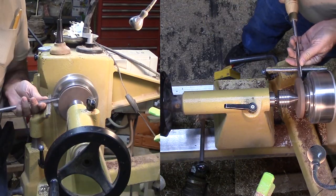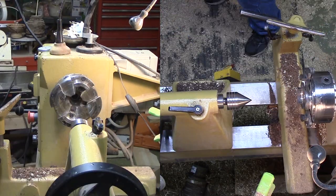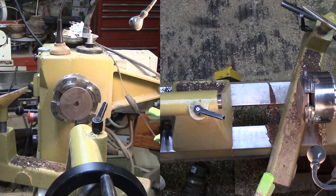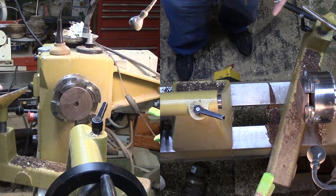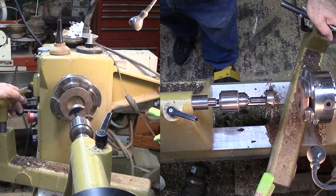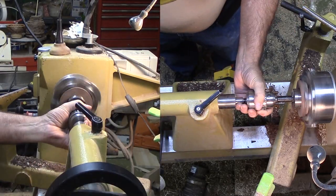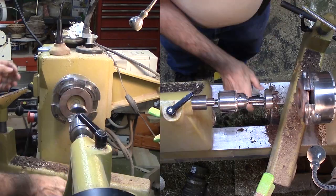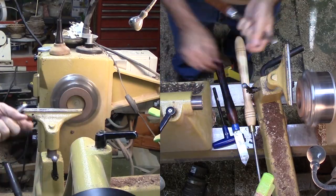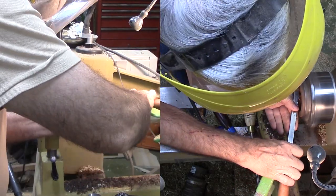Now for the bottom ring. It is a smidgen too large for my smaller jaws, so I've mounted it with the jaws closed with the wood pressed between the jaws and a rubber stopper on the live center. With it now perfectly round and a trifle smaller, I can put it in the jaws with a little spacer between the wood and drill out what will become the hollow of the foot. This hole goes clear through the wood and is followed by drilling a slightly larger hole. This will be the mortise for the plywood bottom. That was my largest bit, so I'm enlarging the hole just a little more.